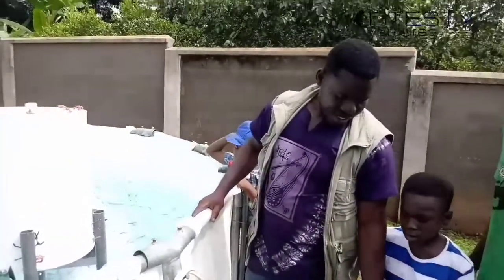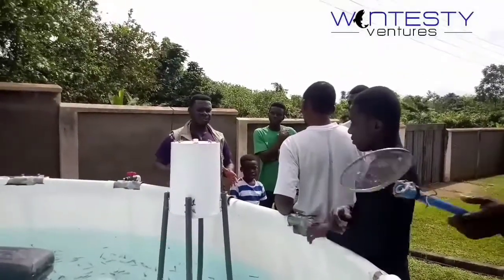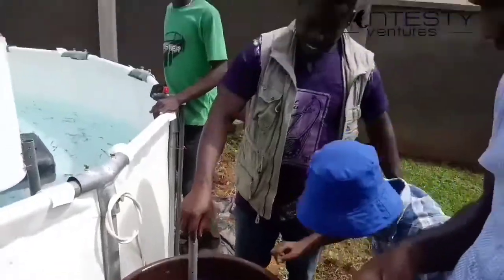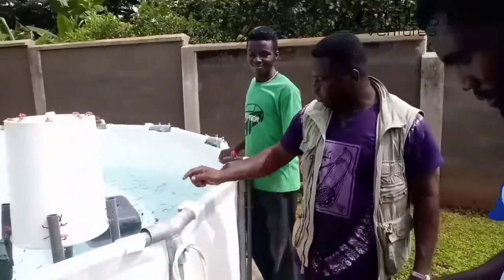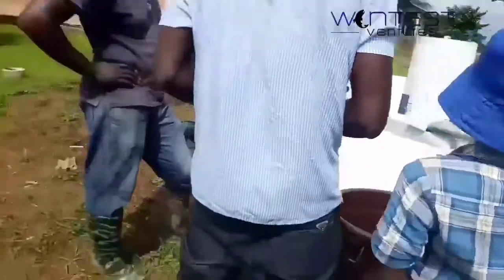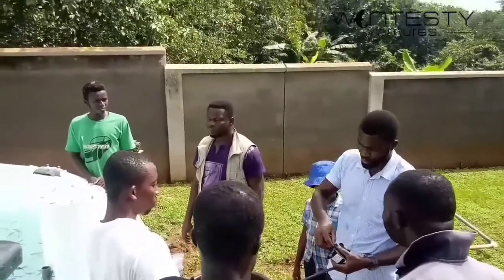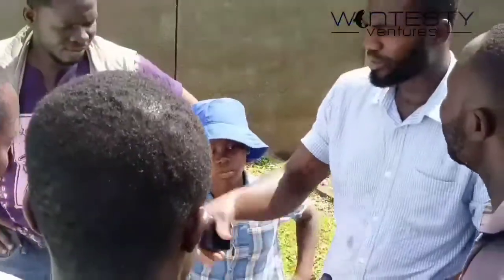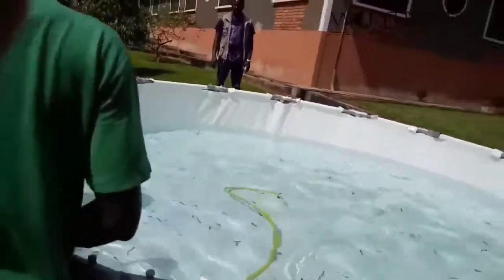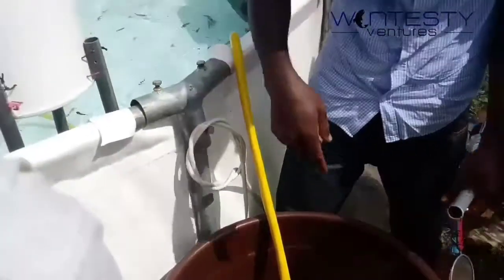Let me take this opportunity to explain the principle behind the pond biofiltration system. The biofiltration system has two pumps basically. There's one that stirs the water in a centrifugal flow action, pushing waste from the periphery of the pond to the center for collection by a set of water hoses that brings waste from the bottom of the water into a sedimentation tank that has a filter. This is how we draw water from the pond into the sedimentation tank for filtering.